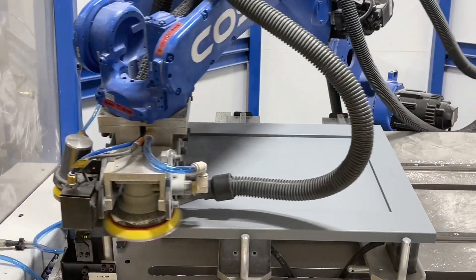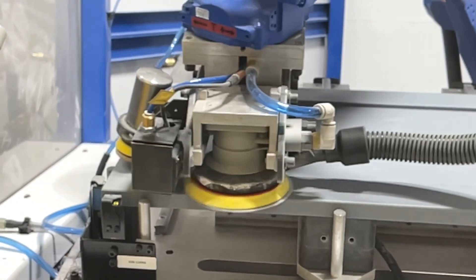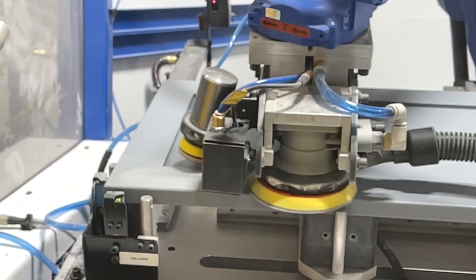This time we set it at 100 milliseconds and you'll see the sander comes on at exactly the right time. At full speed it's almost impossible to detect, but let's slow it down — and you can watch that as soon as it touches, it turns on and goes. And there you have it. All of the sanders can have that same control in the settings screen. That's how you get your sander coming on at exactly the right time.